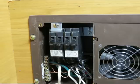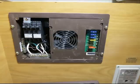So everybody's got their own breaker, and so for my trailer, the house power on one side of the trailer is on one circuit breaker, and the house power on the other side of the trailer is on the other circuit breaker. And then the last circuit breaker goes to the converter itself, which you never know, the converter could catch fire, ground out, or short. So it's nice to have its own breaker, and it probably doesn't really even need a 20 amp breaker. I could have put a 15 amp breaker in there, but it has a 20 amp breaker in there.